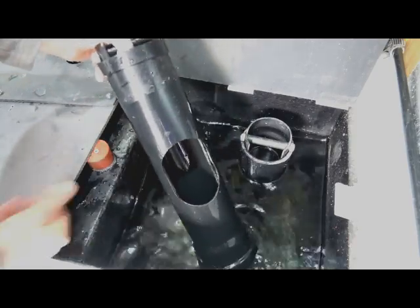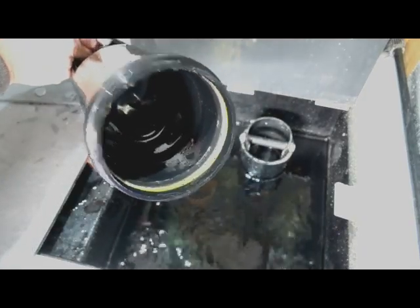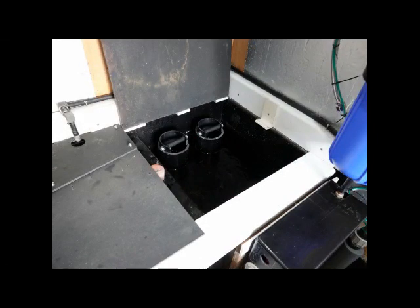So how do they work? They are extremely simple to make and operate, therefore incredibly reliable, very simple, don't go wrong. And honestly, I would use these in preference to ball valves, given the choice. Anyway, back to the inlet chamber. The right-hand side standpipe valve is for the skimmer, and the left-hand one is for the bottom drain. If I want to purge the bottom drain, I can either close both valves and drop the level in the drum filter, or better still, I have a separate chamber — not shown here — which gives me an instant 70 centimetres plus of head with a standpipe, giving me a very, very rapid flush. Much better than a conventional flush, which I do about once a month. Also, with the standpipe chamber and inlet chamber, I can see the water coming in — actually see the water — and all my water testing I do just here. I needn't go out to the pond, because this is pond water coming in and very easy to access.